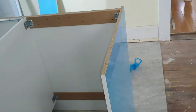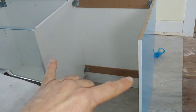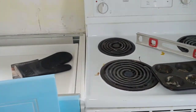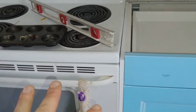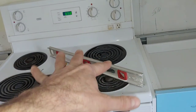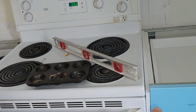I don't know if this end panel is going to be strong enough, and I really don't know what holds the slab of stone — it basically just sits on here. There were a couple of mistakes in my kit — I got an extra drawer piece and I'm missing hinges. The opening is supposed to be 24 inches for a standard dishwasher; I made it 24 and a half for a little fudge factor on each edge since the floors are so uneven. For example, my stove opening I made exactly 30 inches, and as you can see it's a nice tight fit — but when I get my new stove in I'll want to level and move it around.